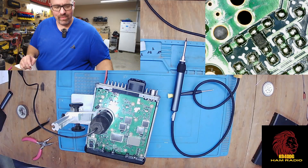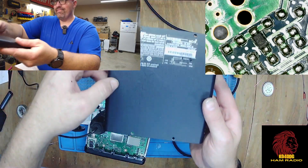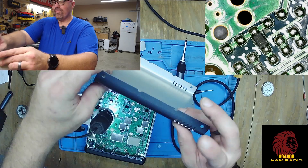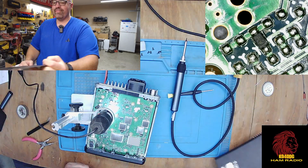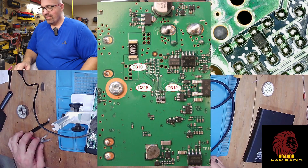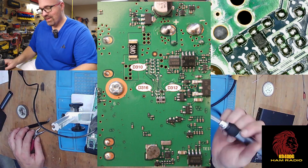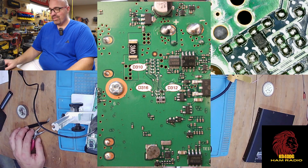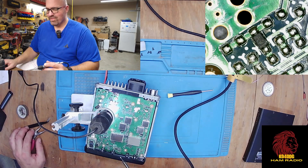Okay, now we're on the bench here with the radio. I already have the cover open to make it easy. You have eight screws to remove. Get the cover off and when you're at the cover, follow my diagram which I have here to show you what chips to remove. Basically, you want to make sure the UHF port is on the left. Now the video shows it on the right, but I guess it's mirrored — just make sure it's on your left.